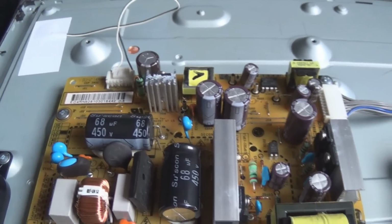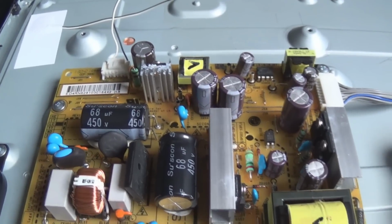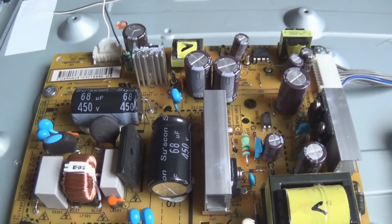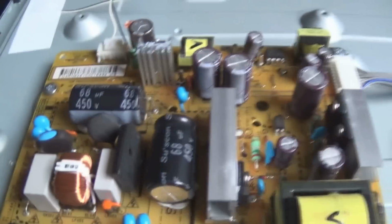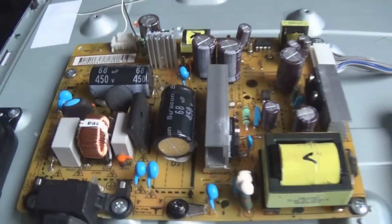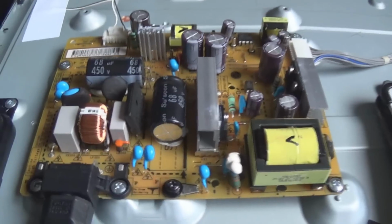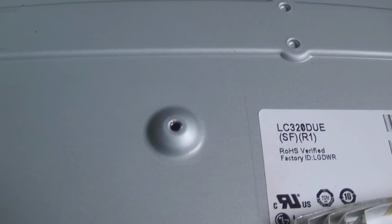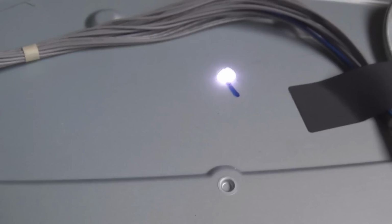So then I was tracking it down, and I found that the LED driver chip was actually faulty. It was getting all of its signals to drive the MOSFET, but it was only outputting about 0.6 volts for the VCC for the MOSFETs, and that's not enough to turn them on basically. So I changed the LED driver, and in standby right now, as you see, after changing it, backlight straight away.